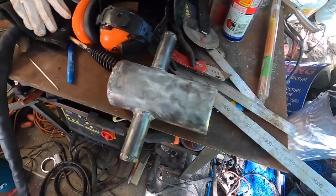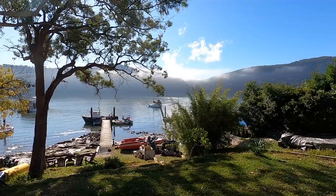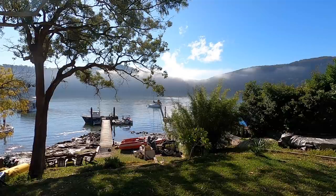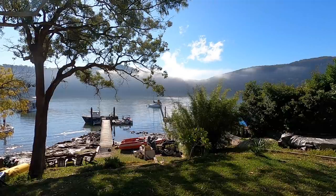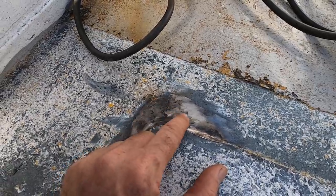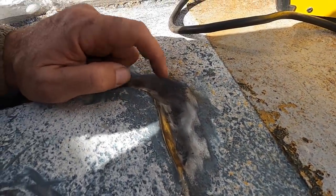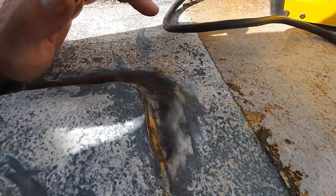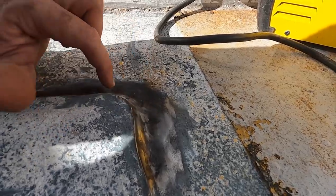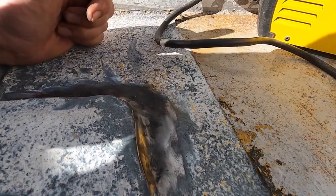I'll weld it on first then put primer on it, otherwise it's just going to burn off again. With the post off I couldn't easily put it back on the mooring, so big thanks to Dave for letting me put it on his wharf overnight. Renko's about twice the length of your average tinny - 9 metres compared to say a 4.5 metre tinny. This is the rust that Doran needle-gunned out - given the deck is only 3 or 4mm thick, this has got to be sub-millimetre thick, so I'm going to try and pad weld it up.